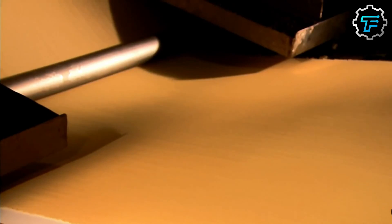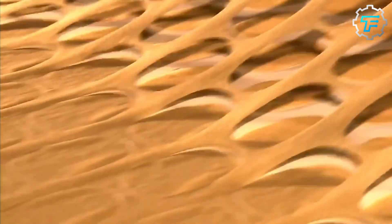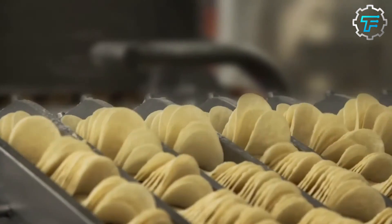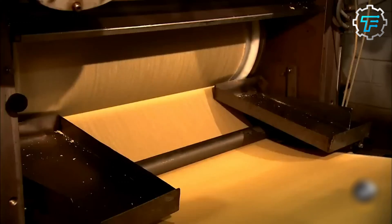This is done by mechanical rollers, which apply about two tons of pressure to the dough as it moves on the conveyor below. This process lasts just a few seconds before the conveyor transports the flat potato sheet to rotary cutters. Just like with the rollers, these cutters also roll on the potato sheet, except they consist of several oval-shaped cutters, which cut the flat sheet into hundreds of oval-shaped flattened doughs. As the conveyor moves away from the cutter, another device pulls off the scrap dough left from the cutting, and this scrap is recycled and flattened again with a new batch of uncut potato sheets.